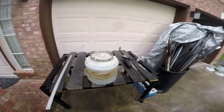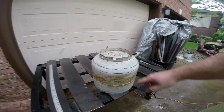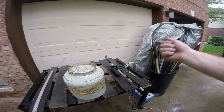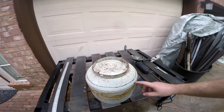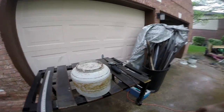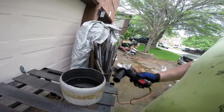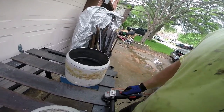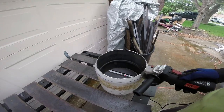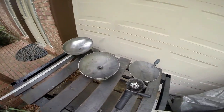I had a thought — since we're adding one tank on top of the other, let's buy ourselves another inch by leaving a little lip that goes into the bottom of the upper tank. It'll help us center it vertically, weld it into place, get a nice solid welded seam all the way around, and when we fill the inside with refractory cement it won't matter if there's a little bump because the cement will be smooth on the inside. A couple of cutting tips: when you're cutting on an angle like this, keep your grinder parallel with the surface of your work table. Don't try to follow the curve around — instead, cut in at an angle and smoothly cut all the way across to get a nice smooth cut.